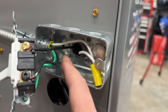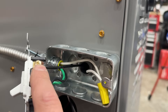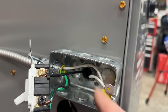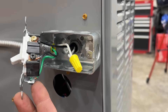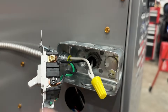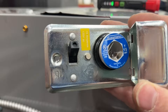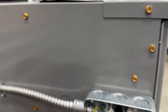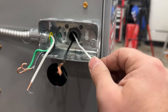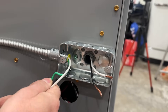Now that we have the switch removed and the breaker turned off, we're just going to verify by going over these power leads and making sure there's no juice going to this. This is your main hot wire coming out from the grid power from your breaker panel, and this is the hot wire going in to power your furnace. We have our neutral tied together here and our ground on the bottom of the switch. Alternatively, you might have something like this that has a fuse, but the same thing is going to apply — kill power, remove it all, and these are the wires going to the furnace and from the breaker panel.